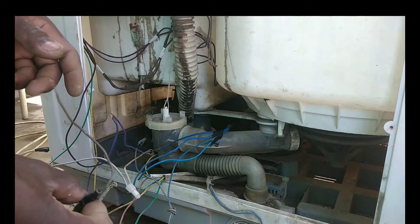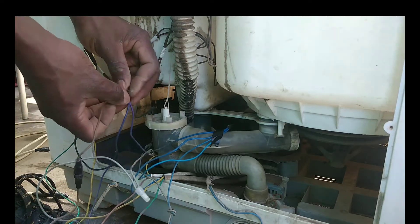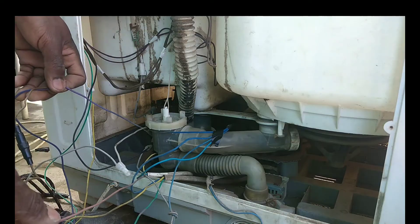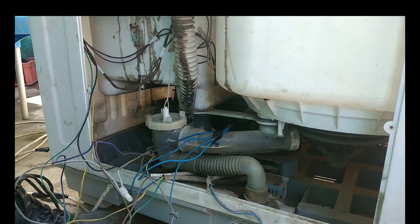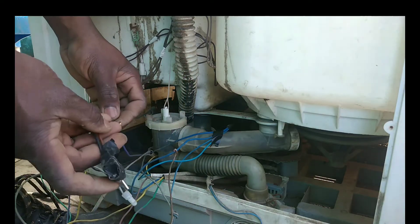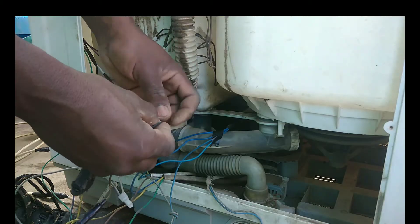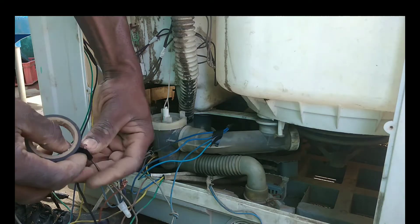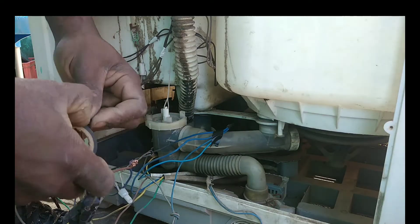On those capacitor cables, I put my live cable coming from the power cord. We need to make it simple by adding a switch between those to operate this easily. Apply masking tape temporarily on each cable end to avoid short circuit.